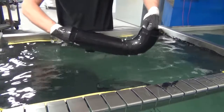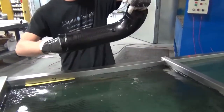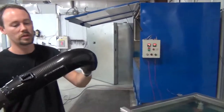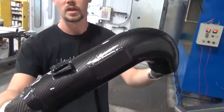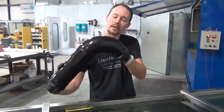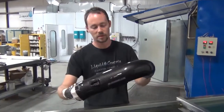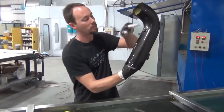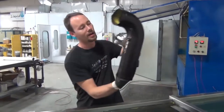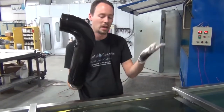So it looks like we got a little bit of a blowout right in here — essentially the water beat the film in. Not really a big deal because again, what you're going to be seeing is from that right there, and that looks really good on this spot right in here. So you can see it wrapped all the way around in here, wrapped all the way around where the face plate goes, and looks like it wrapped around all the way everywhere else. So I would say that's definitely a good dip, good hit. We can come back in if we wanted to, we can black that in. If you absolutely wanted to, you could come back, try it again, maybe go a little bit slower — it would probably come back up and touch. But again, because you'll never see that spot, we'll probably come back in, black it in just a little bit and you're good to go.